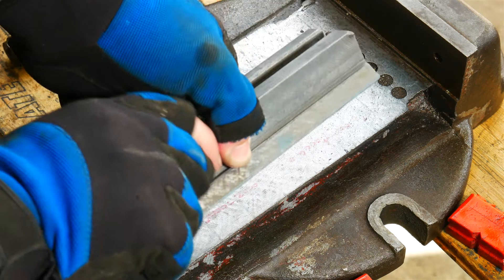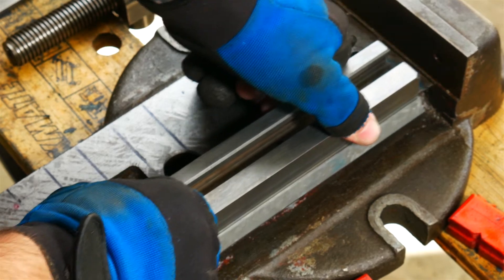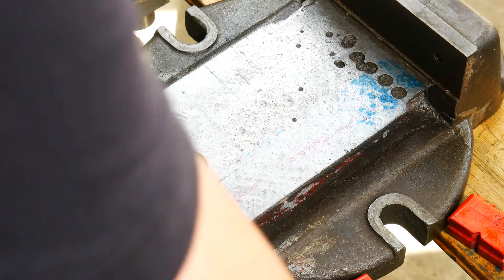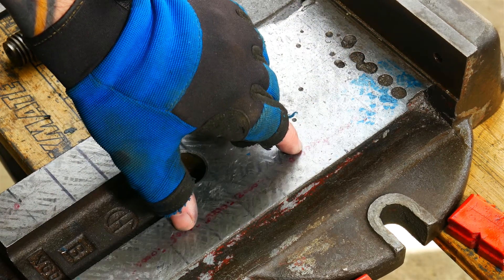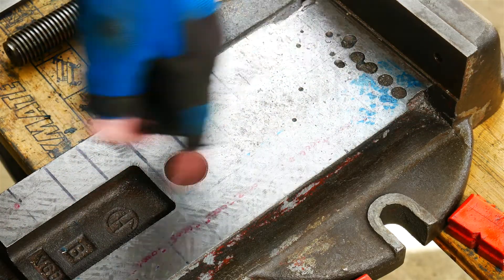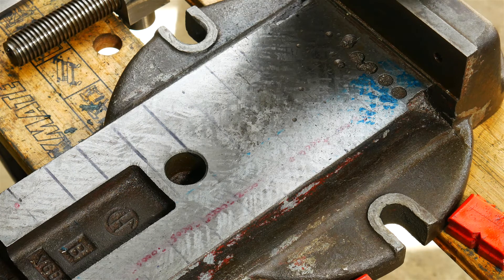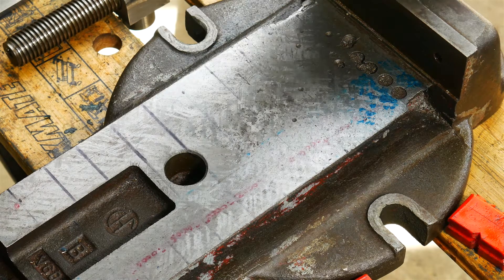So we grab our straight edge and start the whole process all over again. Up and down the part a little — when you know there's a dip you don't want to go too far because you don't want to be blueing up the dip as well. As you can see the marks have crept in a little bit; as we take more and more off they'll gradually creep in until they're all together. Bear in mind we have to do this whole surface, so we don't just blue it up in a line — we go across and diagonals and make sure everything is flat and crucially parallel to the rest of the base. Well, I hope that's been informative and useful to somebody, and when you're playing with this stuff, try not to end up looking like a Smurf.